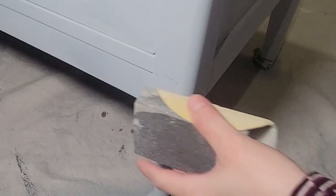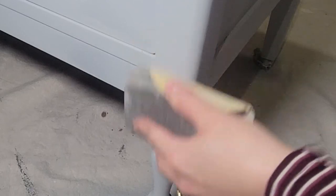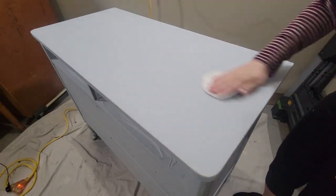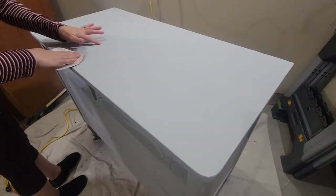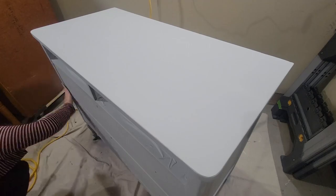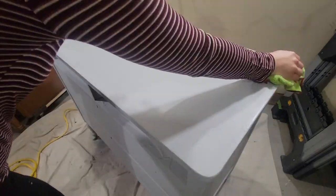Surprisingly I only had a couple of drips, which I let dry and then sanded off with 220 grit sandpaper. The spray gun itself did not provide any texture when spraying. To get any little bits that might have fallen on the primer, I just used 600 grit and lightly went over the piece to get rid of any little hairs or anything. Once the sanding was all done, I just wiped away all the dust with a damp rag.